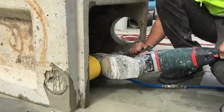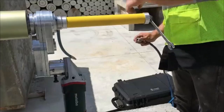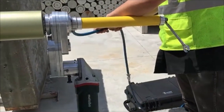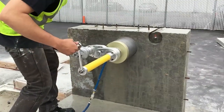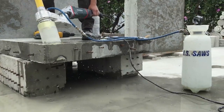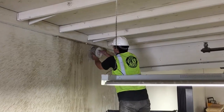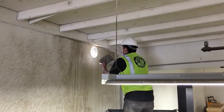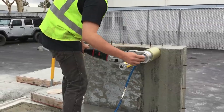As a result, there is practically no trace left after drilling. Drilling water can be supplied from any source. The device allows drilling holes from 3 to 10 inches in diameter. The weight of the device along with drilling nozzles is 48.5 pounds, which ensures single-person operation. The machine can also drill holes in masonry of any thickness.